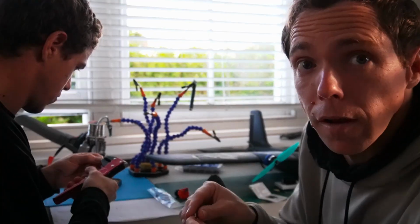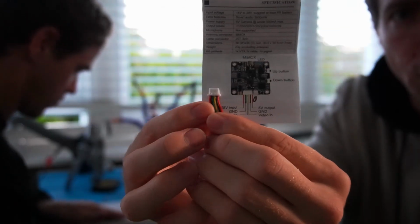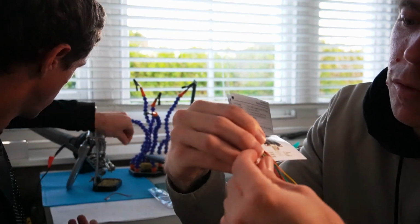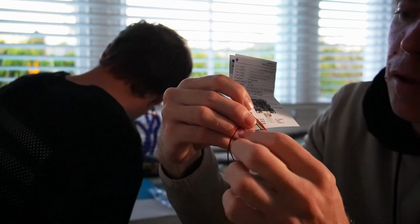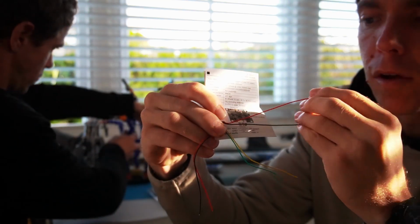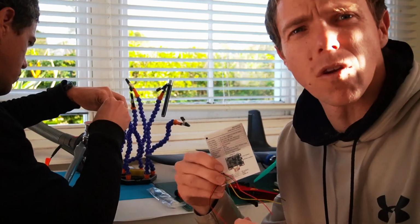In this particular wiring diagram, I'm working on the video, by the way, the camera, and Harry's working on the VTX. Camera: positive on the right, or on your left, and then we go black. Those are the ones from the power. After that we have 5 volts, which goes to the camera, and the ground for that too. And signal, of course, goes to the camera. We won't bother with smart audio, so we won't need it.